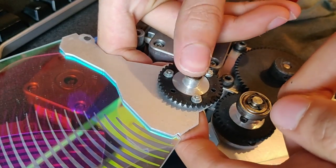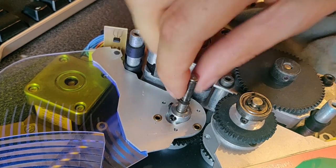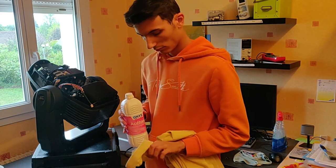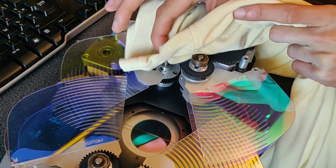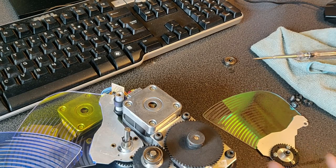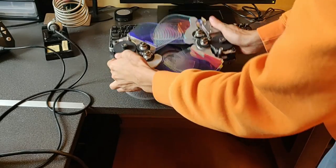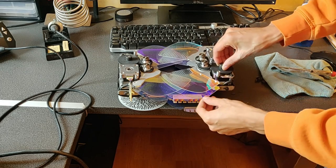It's very sticky — the grease is completely dry. So I need to clean this up and I'm going to use acetone for that. Then to lubricate the bearing, I'm going to put some of the thinnest oil I can find — the Molykote D321 or similar. And now I can move them independently much easier. Very nice, super cool.